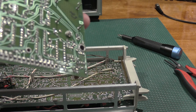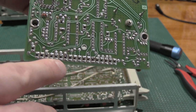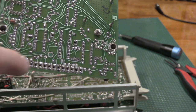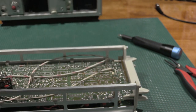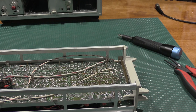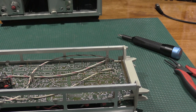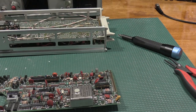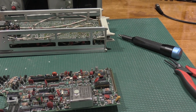These through pins from Tektronix, these are notorious for cracking solder joints, so I would not be surprised if our problem is in here or on one of these other pins, so I'm definitely going to retouch all of those. As a matter of fact, this one doesn't look too good just in the camera. But we'll be hitting those, and we'll see if that makes our intermittent go away. So I got a little bit of work to do, so I'm going to get to it, and it's not going to be anything interesting. It's just going to be running the iron for a while, so I will skip all of that,